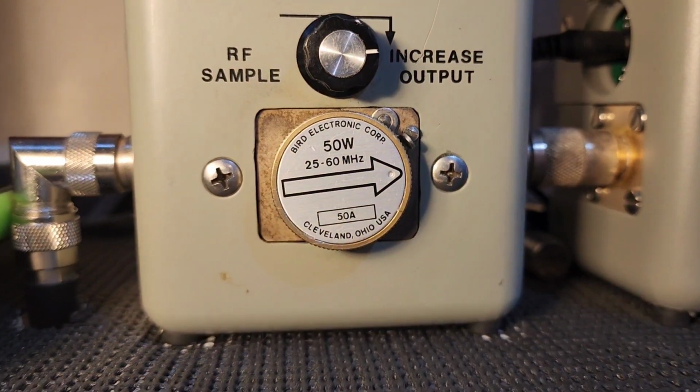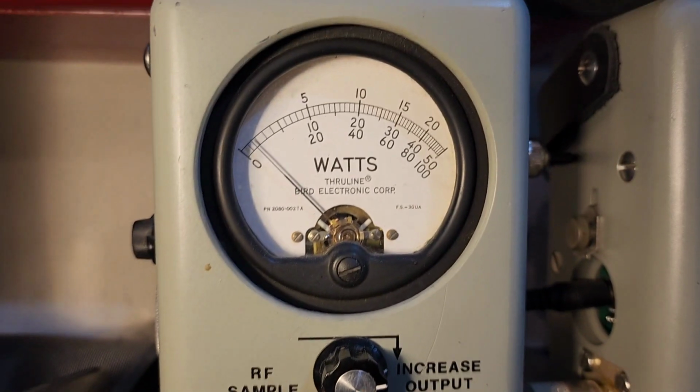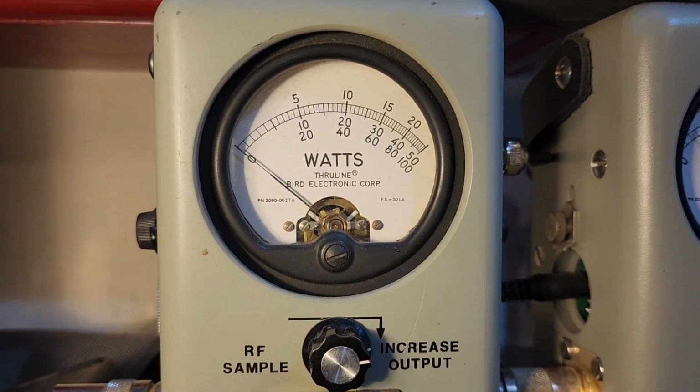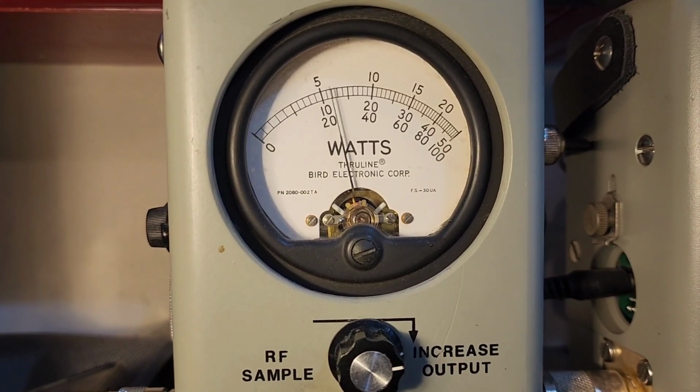Robert, let's get right to it. RF power all the way down, 50-watt slug. You got your tune alignment and Toshiba voltage regulator upgrade. There you are at 1 watt all the way down. That way you have full adjustability if you decide to run a 4-pill or something.